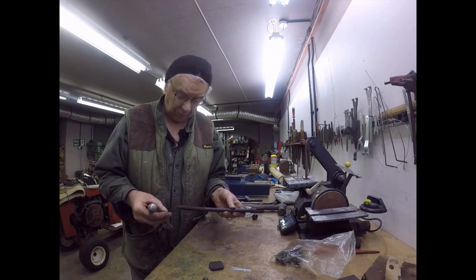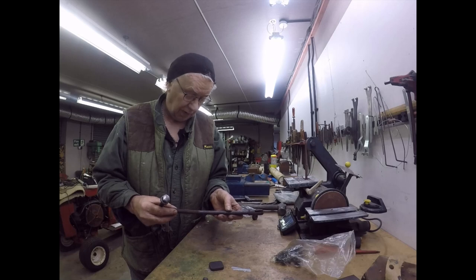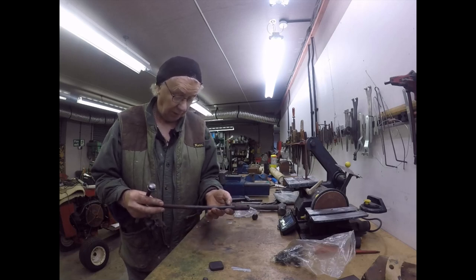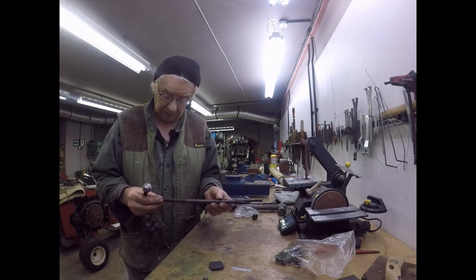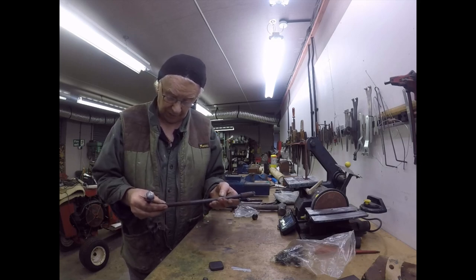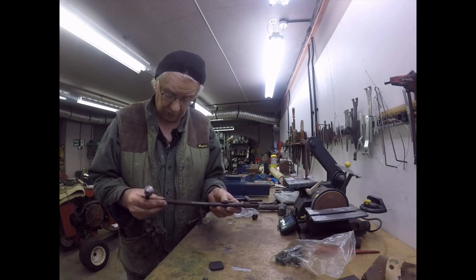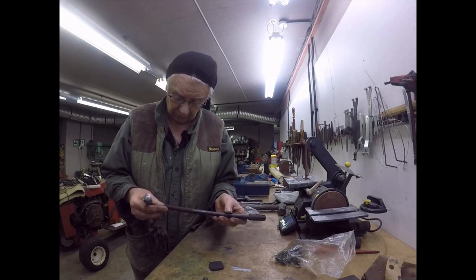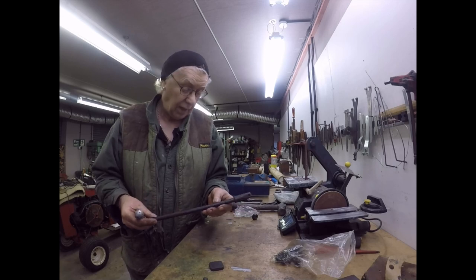So I'm going to make that the outer end and put the Whitworth thread on that end. This is actually half inch dead, so it's the right size for the Whitworth thread as far as I can see. It's about a thou up, but that doesn't make any difference. And I can put, I don't know what thread that is. I'm not quite sure. It's not M12. I'll have to measure that up. I've probably got a nut for it anyway.